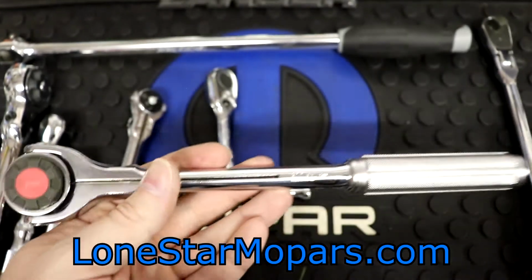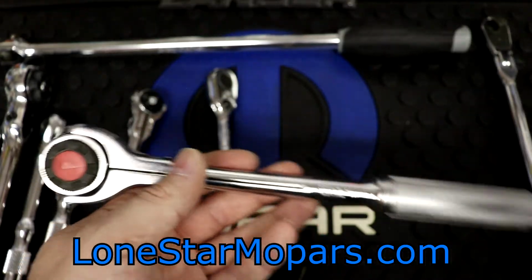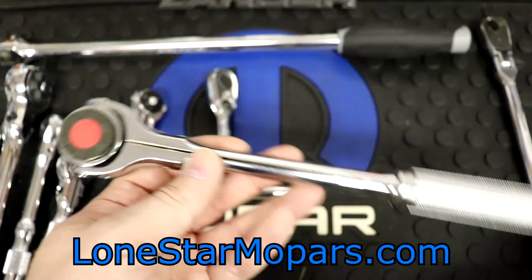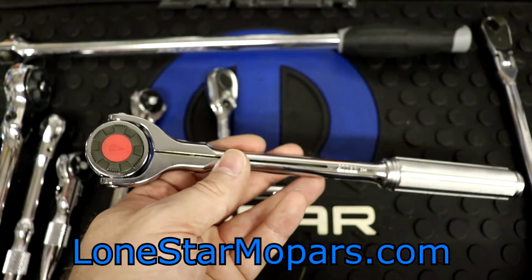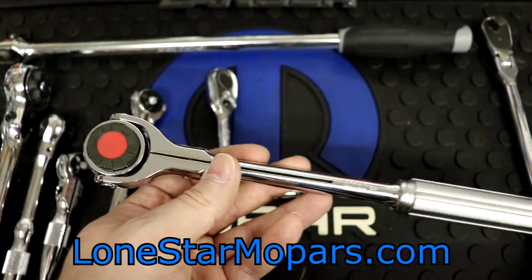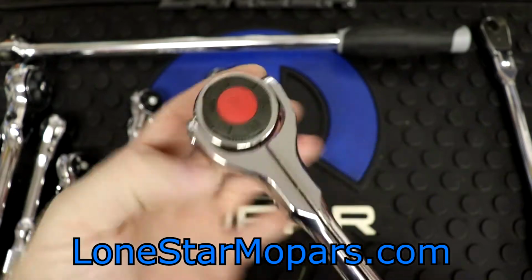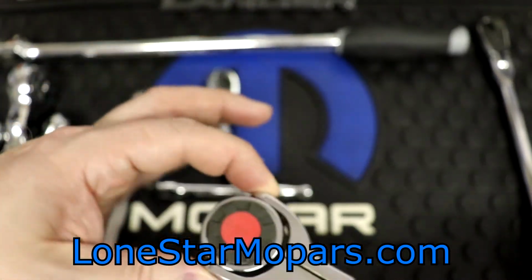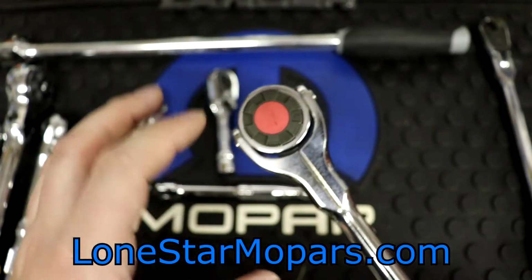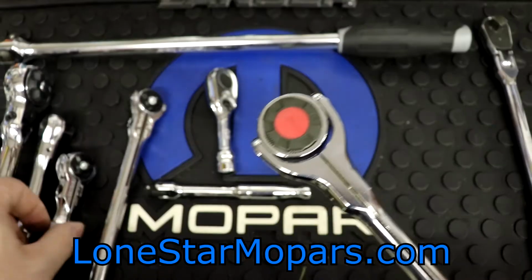So the biggest knock on this one is the size, in terms of the Koken Z series, and if you're thinking of automotive stuff, this ratchet has a very large head. Did I give dimensions? I don't know that I did. Right here, end to end, this pin to this pin, this yoke to this yoke, flip a paper football through the uprights, 44 millimeters. All right, that's significant.